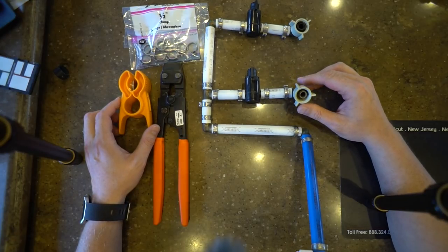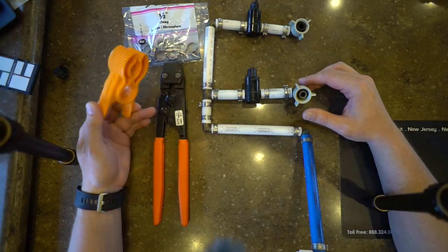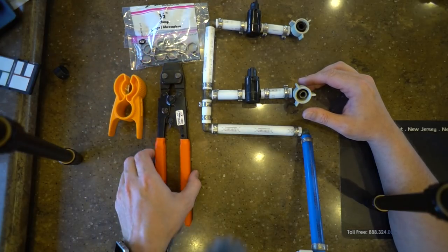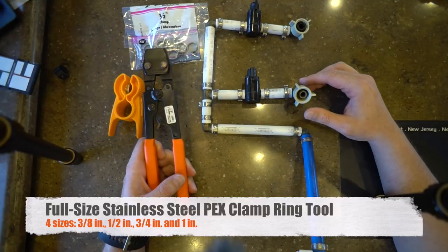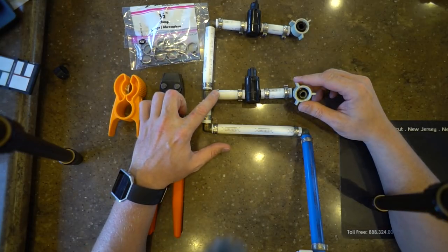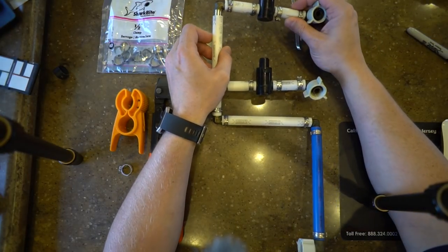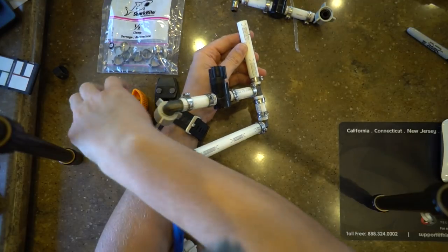Here's our little plumbing tree — I'm not sure that's a technical term but I've always called them trees because they kind of have branches. A couple of different tools here: this is a PEX cutting tool made by SharkBite. We like it because it's inexpensive and it does half-inch, three-quarter, and one-inch PEX all with a single cutter, which is pretty portable. This is a PEX crimp tool — I know it does half-inch and three-quarter, and I'll note whether it does one-inch in the description. What it does is crimp these small clamps which hold between your unions and your PEX to give you a watertight fitting.